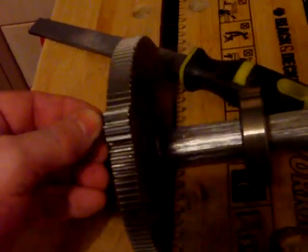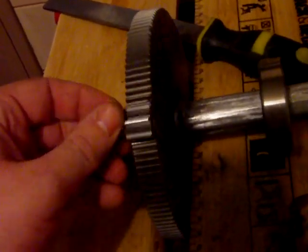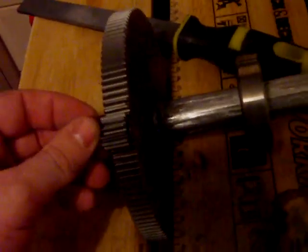I'm going to put some spacers either side of it to stop the gear moving. So when I've got the stepper motor gearbox assembled, it's only moving this giant gear around with no risk of it shifting or shearing. This should also be reasonably windproof, because with a small gear driving a big gear, it increases torque but decreases speed — and you want high torque to move that giant mirror.